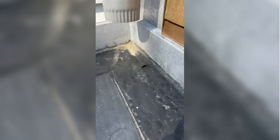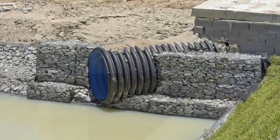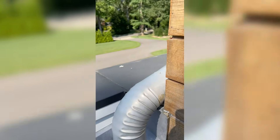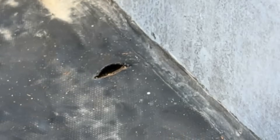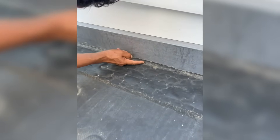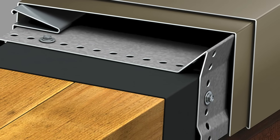Take a look at this downspout and where it's discharging. The downspout for the upper floor roof is just dumping water directly onto the surface of the flat roof below, rather than extending to grade or to a buried stormwater pipe. All of that water from the roof above is now concentrated at one location and is challenging the roof membrane. Look where the deterioration is and where the blisters appeared — it's right underneath where that downspout terminates, which suggests water was challenging this location, weakened the adhesives, and potentially migrated through the EPDM seam tape.